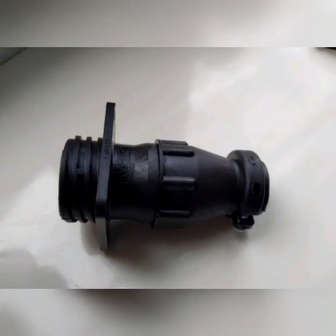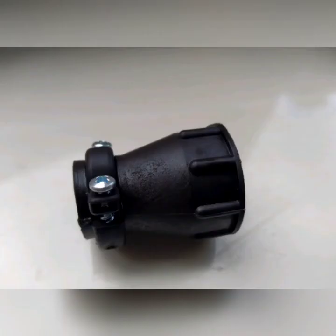These connectors are compatible with the Volvo Penta ones that were supplied. They do have a slight difference in that the Volvo Penta ones had a rubber sheath at either end. These new connectors have a screw-on sheath which is rigid plastic and clamps the cable to keep the whole thing completely rigid. It is without doubt the most secure way of doing your wiring on your boat and will not shake loose, but once more is not designed to be waterproof.